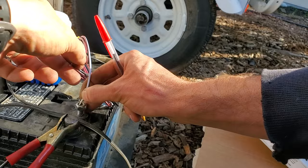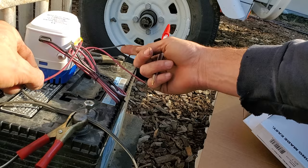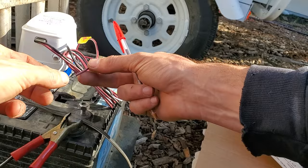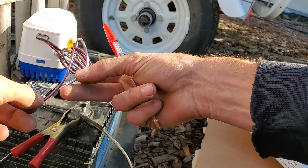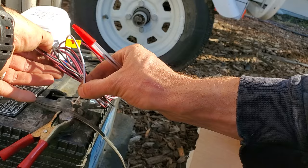If you had to wire one of these up into your boat where you previously just had the two-wire kind, you'd connect the black to the same ground that you previously had. And you'd connect the wire that was originally going to the switch at the front — which would have had two wires, one 12-volt coming in and a 12-volt going out — connected straight to this one, so when you press the button it goes on, and when you kill the button it goes off. This other wire is the new wire. You just put a little 12-volt fuse on it, connect it to your battery positive, and it just sits there. It's not going to use any electricity — the moment it finds water, it's going to flip on and flip off.